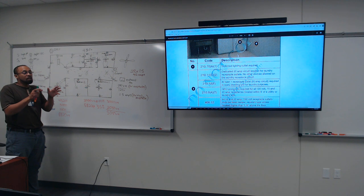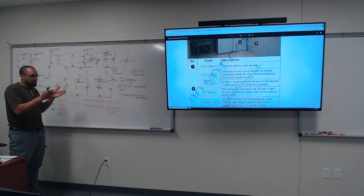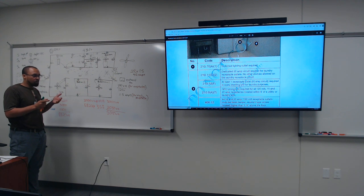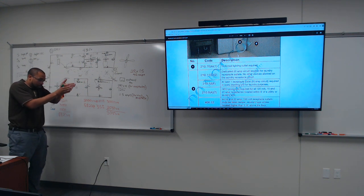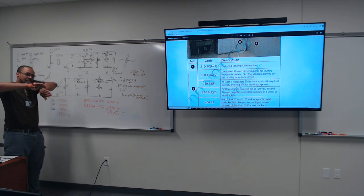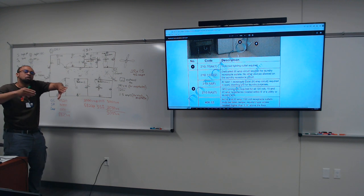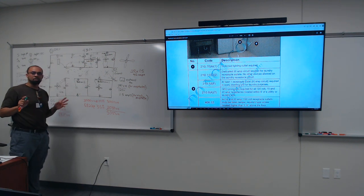Anyway, this is what we're doing. We're basically trying to figure out the amount of space. Normally, typically it's 40 spaces. You're gonna have to use double pole breakers for 240 equipment. And then you're gonna have lights and plug. If you have enough space to separate the plug from the light, you can do so. But if you don't have enough space available to separate the lights and the plug, then guess what, gentlemen? You're gonna have to put the lights into the plug circuit breaker. Y'all follow what I'm saying now?